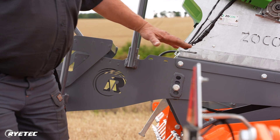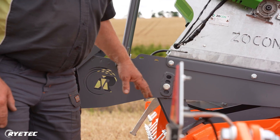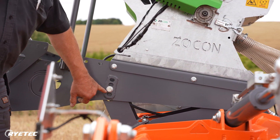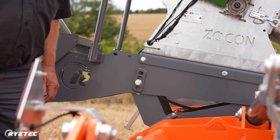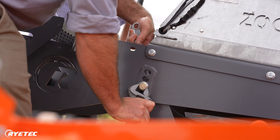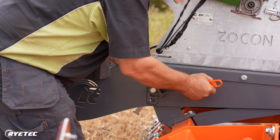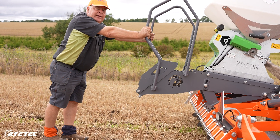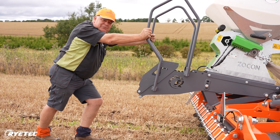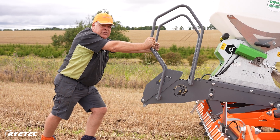You can see the units with the position of the roller leaning forward a bit, so you can adjust the angle of the bracket on this bolt here — we're just going to drop that down a couple of holes. If your tractor is struggling to pull the Restorer, these handles are there to get a bit more assistance and just help push the Restorer through those tough bits.